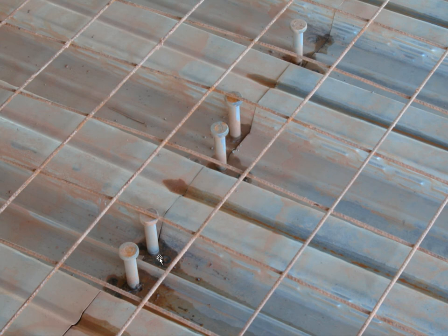So the decking is put on and spot welded down as you can see here. After the fact, the studs are welded on, and then finally this wire mesh is put on. This is called welded wire, and we almost always put it in for shrinkage purposes to minimize cracks. In general it's desirable to make the concrete as strong as possible.